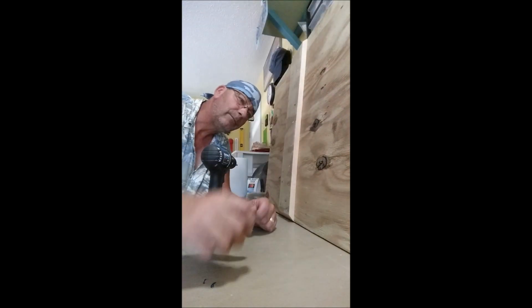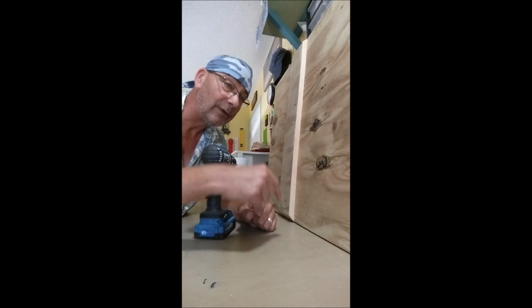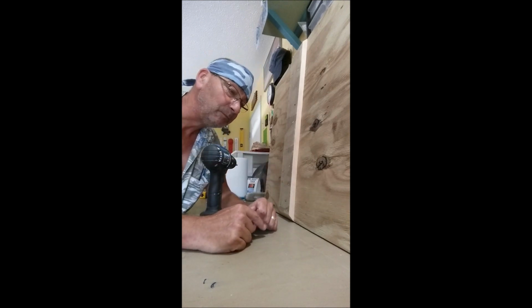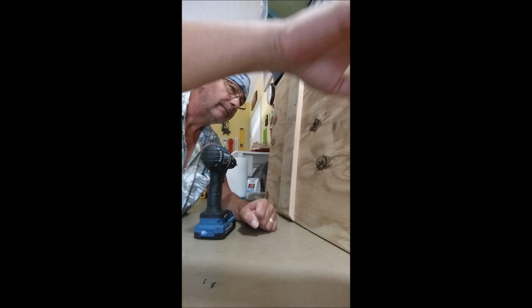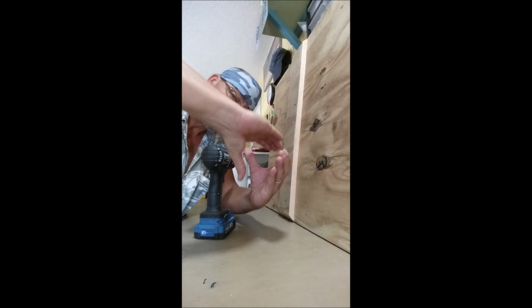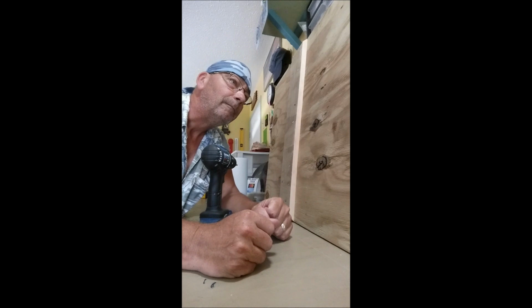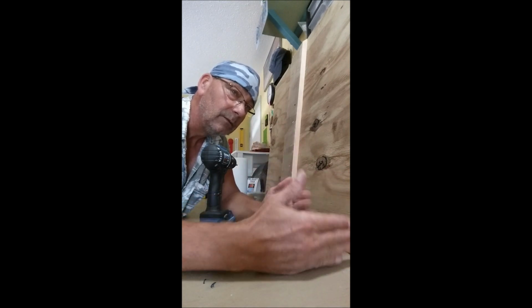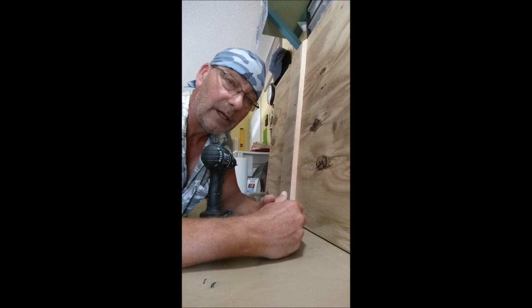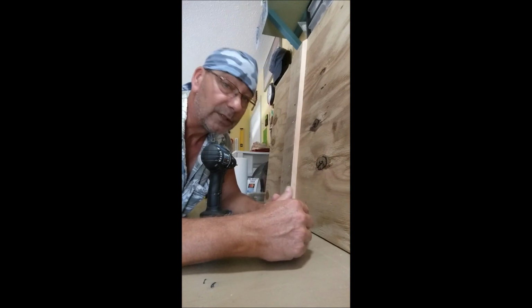And then I'm going to cut the 2x4, and I think I've changed my mind. I believe what I'm going to do, you'll understand why when we actually finish the project and you see the base again, is put a 2x2 across this way also and have the long one running, and I'll notch the center out so they match. Golf clap. That way, I'm thinking it will set on four metal bars, which the table frame is a metal frame, so it'll set up on those better. And we'll see how that goes.